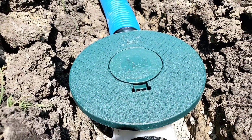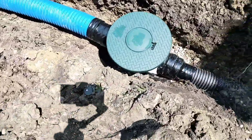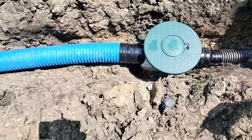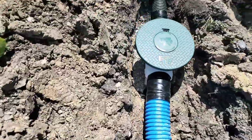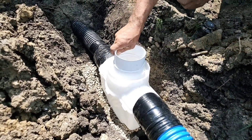Run a 3-inch corrugated pipe all the way to the inline catch basin — we do have a 3-inch coupler that connects to our catch basin. Then you can come out the other side with a 4-inch pipe. Use the solid D-box cover when you're in the landscape.